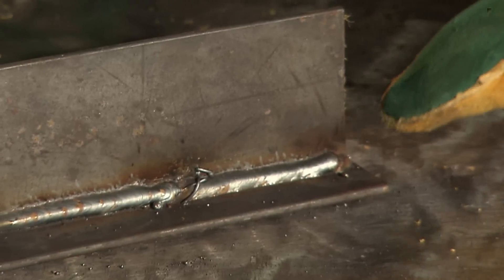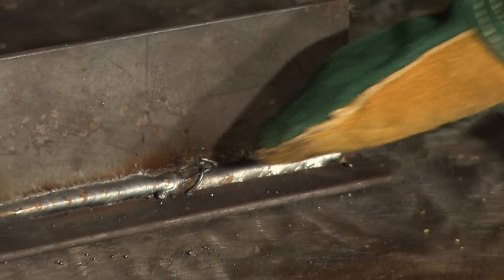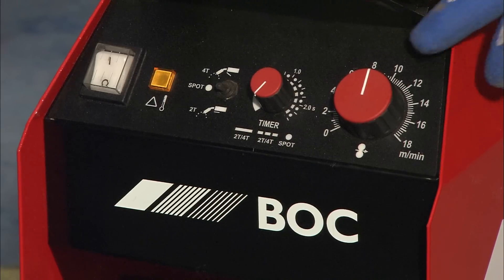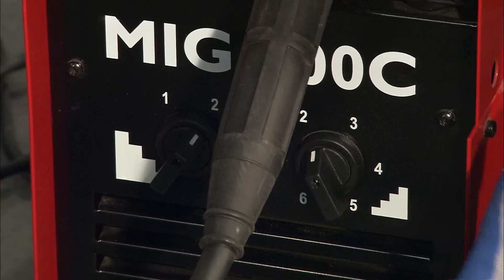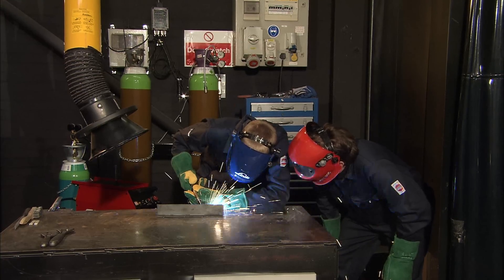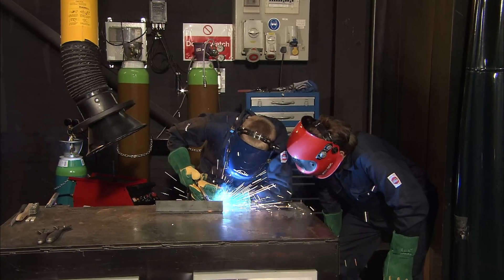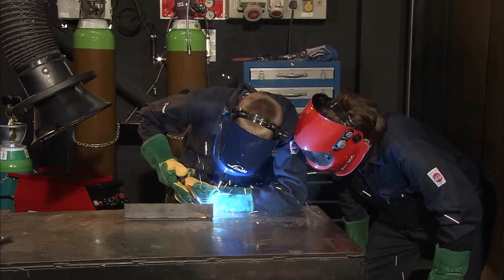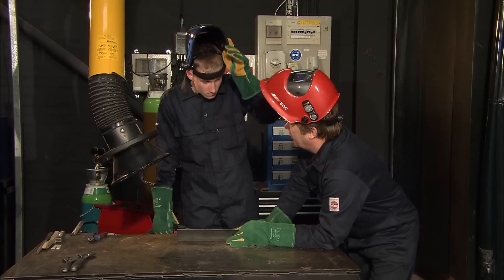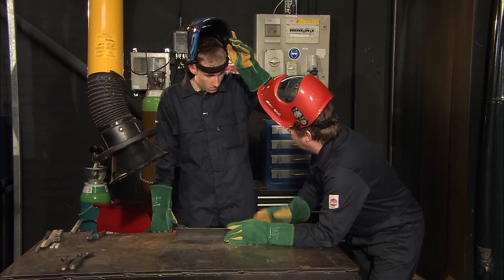Okay Sean, let's have a look at the welds. On the right hand side you can see that the weld is slightly convex, and it's produced a fair bit of spatter there. So what we need to do is turn back the wire feed speed, because initially I think there's too much — it's too fast for the voltage that we set. And if we trimmed it back, it produces a smoother weld but with less spatter. Have a look at that Sean, that's pretty good. For a first attempt, now we've got everything right — the right settings, the right material, the right wire, the right gas, and everything was fine.